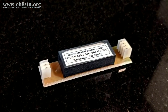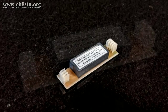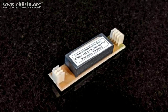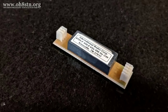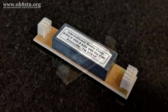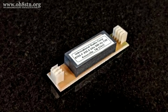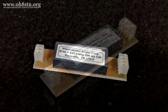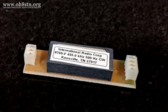One of the incoming modifications for my Yaesu FT817ND is the 500Hz filter. It's called the CW filter, but that's nonsense — this is perfectly fine and actually recommended for narrow bandwidth data modes. If you can find one, definitely grab one. I'll eventually make a video on using these mechanical filters with narrow bandwidth data modes like 500Hz Winlink and JS8 Call.